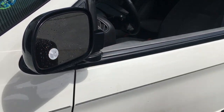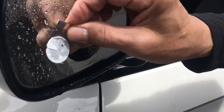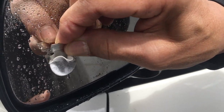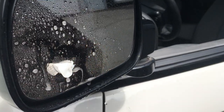That's where you want to grab the razor blade now. The brand of razor blade I like to use is American Line — get it at your local home center. It's nice because it has a good edge and it doesn't scratch the mirror, but you want to make sure you have some lubricant down there so your mirror doesn't get scratched. If you need to spray a little more lubricant, that's what you've got to do.